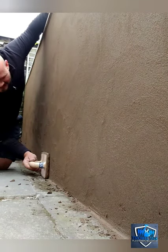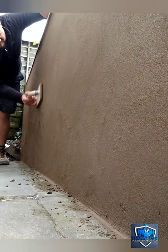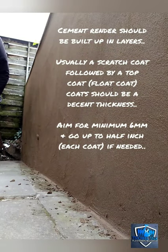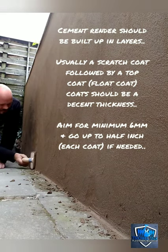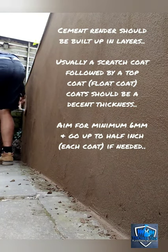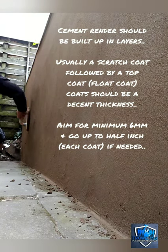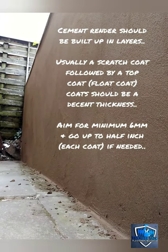You can't just gob it on like you would internal plaster, and spreading is different. You're aiming for between six and eight mil thickness ideally — some spreads go twelve mil, but we find six to eight mil is normally just the trick. Don't go too thin because it'll bring all your stones up to the surface and you'll be forever picking them out. Too thick and it'll just never go off and you'll be there all day waiting, so we find six to eight mil is about bang on.